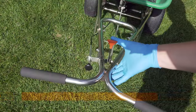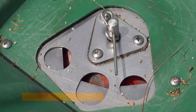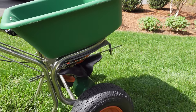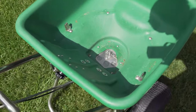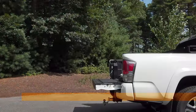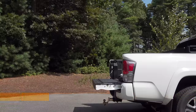Before you put an ounce of anything into your spreader, take a look at all the mechanical parts. That includes the hopper door — you want to make sure it opens smoothly and properly. Also, if you have a side deflector, make sure it's working. Because once you put stuff in the spreader, there's no going back; dumping it out is an absolute pain. This tip is going to save your back, your time, and potentially spilling a lot of fertilizer on the ground.